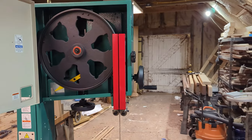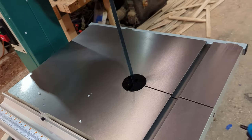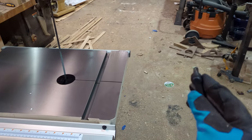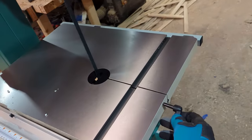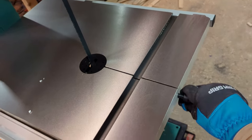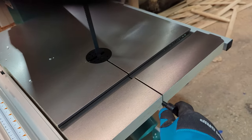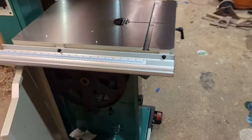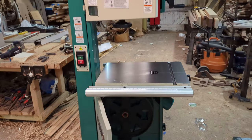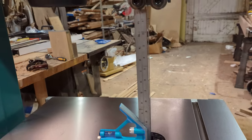The very last thing is getting power hooked up. They also include this table alignment pin — after you put your blade in, you insert this to help keep the table aligned with itself since it's split right there. Apparently it helps keep it aligned, so put that into place and we're ready for power.